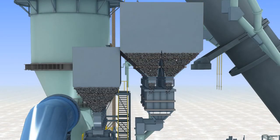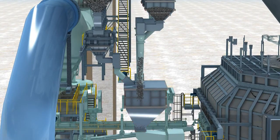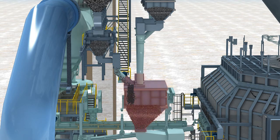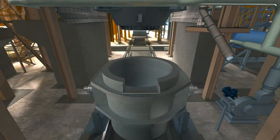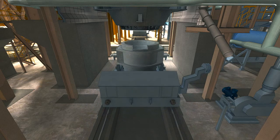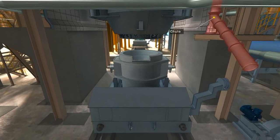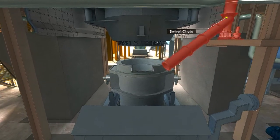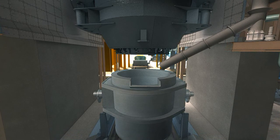During blowing, ferro-alloy and deoxidizer are fed from the storage hopper through the feeder and discharged to the relay hopper. The special ferro-alloy is also weighed and discharged into the relay hopper in the same manner. The teeming ladle transfer car stands by at the tapping position, and the swivel chute rotates to the ladle direction to inject the ferro-alloy. Tapping will start according to the tapping signal.